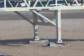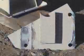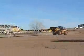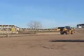Once the Overland Telescoping Conveyor has been moved into location, dolly down the support legs on the main truss and unhook the truck. Remove all transport safety blocks and pins from each end of the main truss. These prevent the head and tail sections from moving during transport. Using a loader, hook a safety lifting chain into the hook on the tail end. Lift the section up about 3 to 4 inches and slowly start pulling the tail section out of the main truss. As the section gets close to being fully extended, it will track and lift into the connection point.